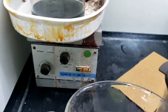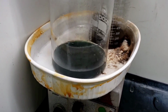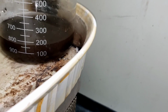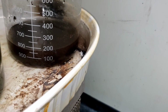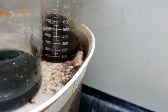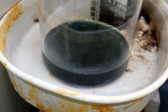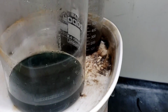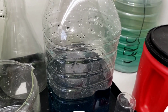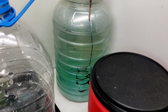So what I did is put a little sulfamic in there, and then I just started hitting it with SMB, and it dropped out. Actually, that's what dropped out. It's still wet, so I can't really guess, but I'd say there's a couple grams there. There might be 3. And a lot of it's powdery, so that's what's in this one. I'm just trying to get it to clump up a little bit so I can put them together, and then put the waste. And this is just straight nitrate, Aqua Regia for gold. There's no silver in this, and that's my nitrate stock pot with silver.